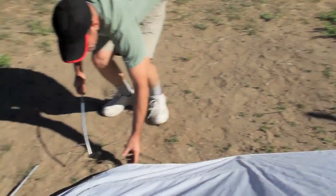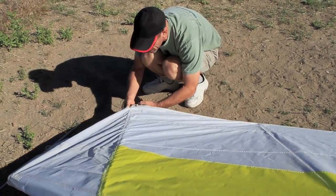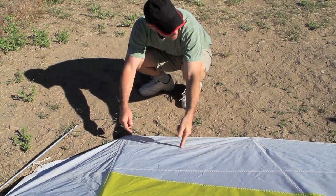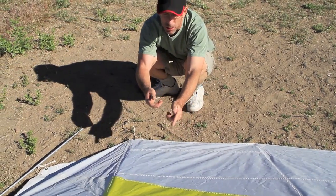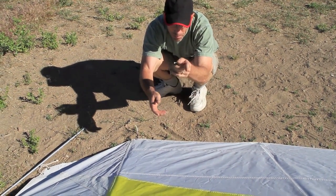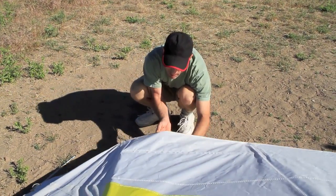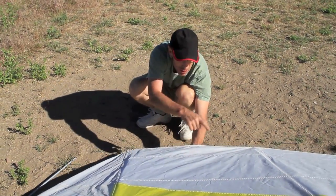This is called a transverse batten. It's on all of our higher performance gliders. All it is is a support — it allows you to have a support tube with battens on either a bridle, a sprog, or a washout tube. A sprog is just a washout tube, a floating washout tube that's mounted off the back of the leading edge, usually internal to the sail with a universal joint and a cable support. But in this case, it's just a fixed washout tube, and it supports these two battens.